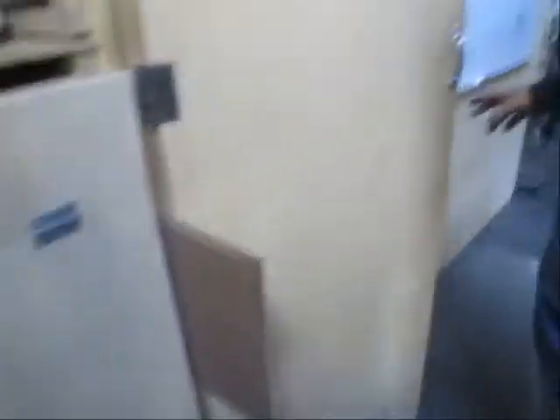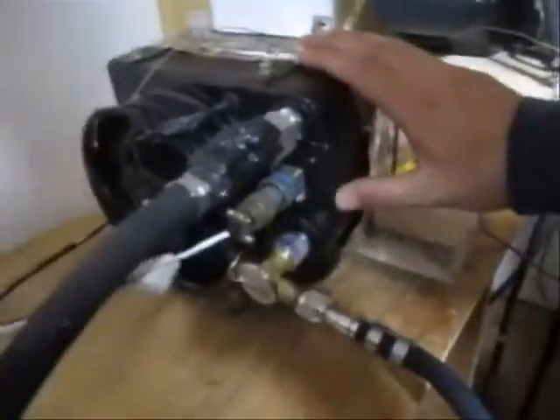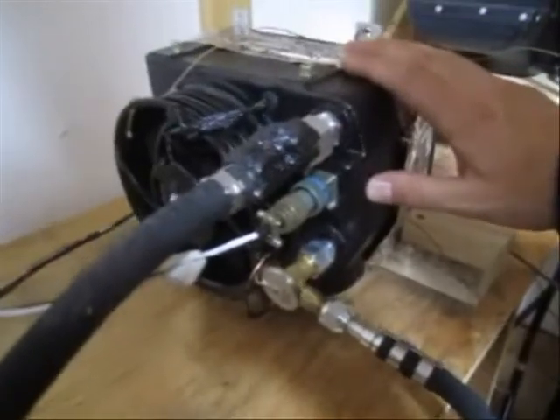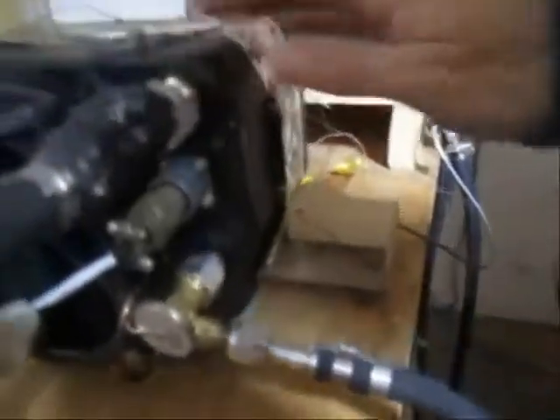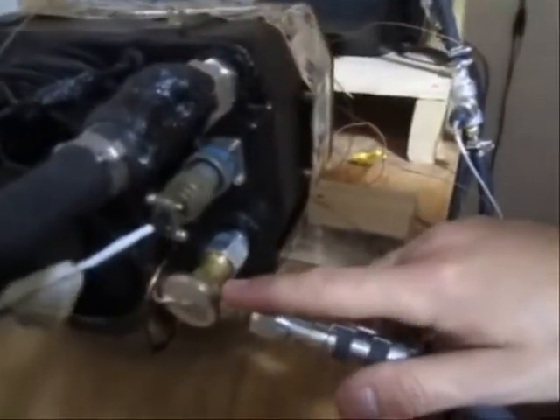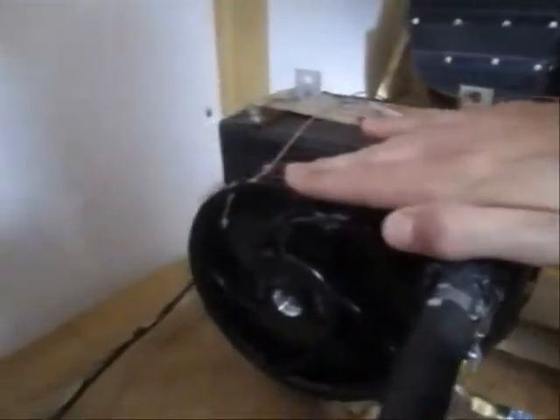Let's walk into our test cell chamber here where we have our evaporator unit. I'm going to show you this blowing at 300 CFM of air. This is also protected by a freeze switch in case of low refrigerant pressure — it will shut off the compressor so it won't crack your coil from freezing water. We have a thermal expansion valve here and our brushless variable speed blower.